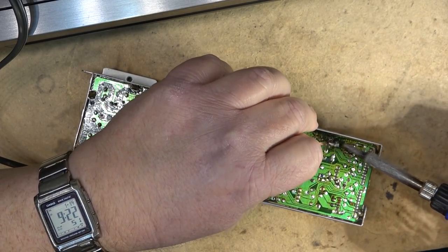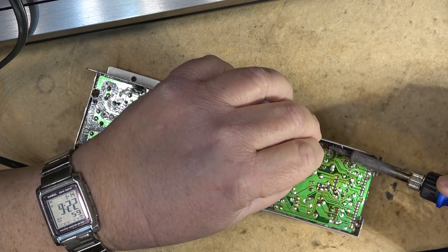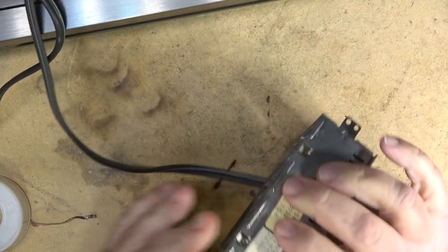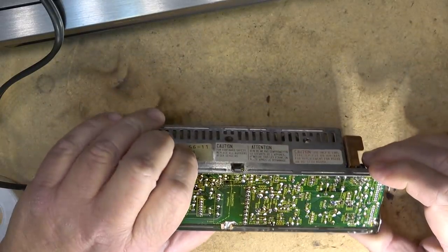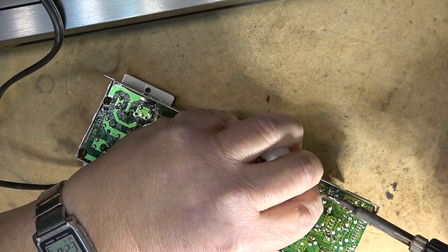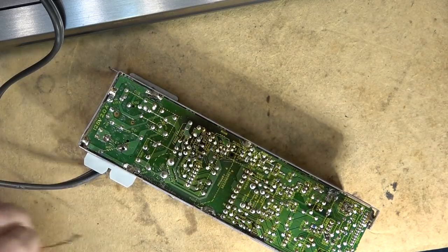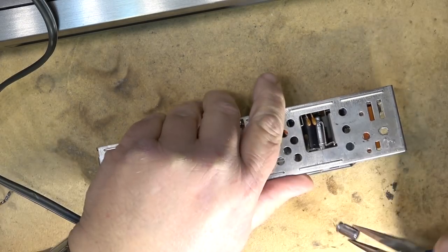The total time to repair one of these units — by the time I got working on it, I started just after nine o'clock and finished around 11:30, so about two and a half hours to deal with the guide, the power supply, and then finding there was no hi-fi audio meaning the hi-fi audio board also had to be rebuilt. These units command quite high dollars on the used market when serviced, because people archiving tapes look for a high-end machine like this for playback.